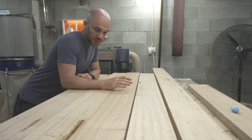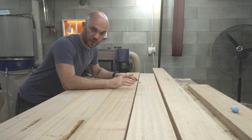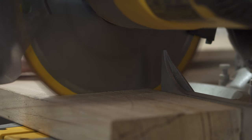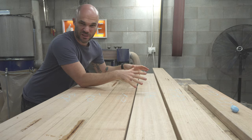This is the timber I'm going to be using. It's Vic Ash, and it's important to note that this is dimensional lumber — 35mm by 140mm. The reason I mention that is you've got a good chance of being able to get timber this size pretty much anywhere you are.